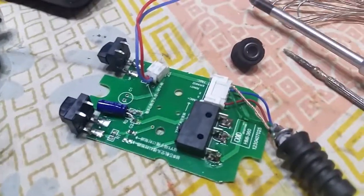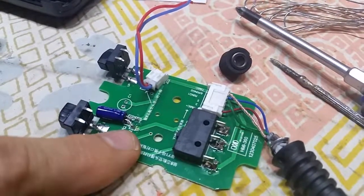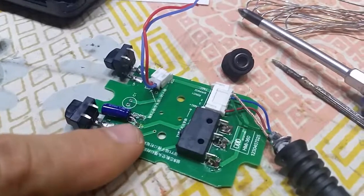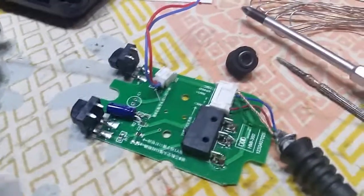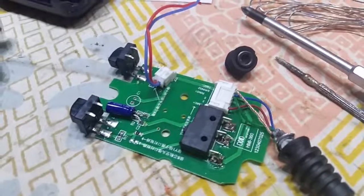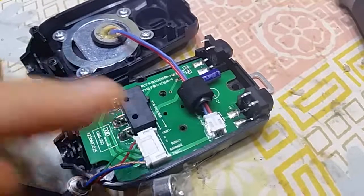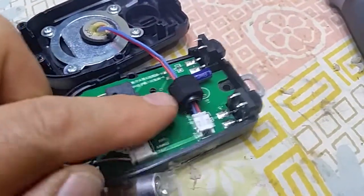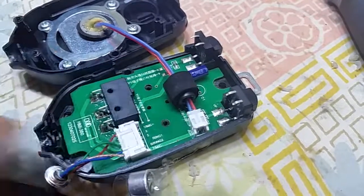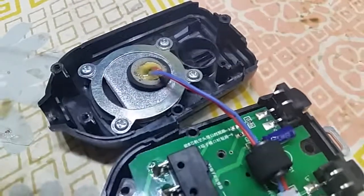I've just cut the lead short on the electrolytic cap, made sure the plus was to the outside, and tack soldered onto the 2 little pads there. Really easy. Just be sure your leads are bent in so they match up on the pads. Tack solder it. Going up in this direction doesn't get in the way of anything in the microphone, so there we go. Easy thing to forget is to put that ferrite bead back on the microphone wire. You'll solder it up and have forgotten to put that on there. So slide that back on there before you solder your element up, and then you can mount it back in, add the blob of hot glue, and secure it in there and wait till it cools off.